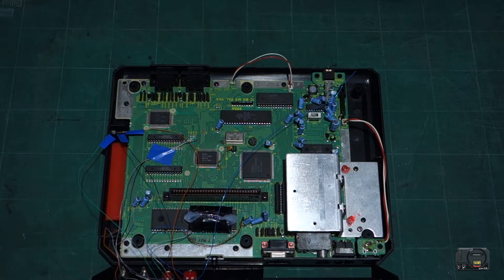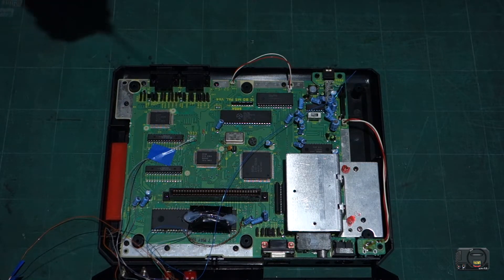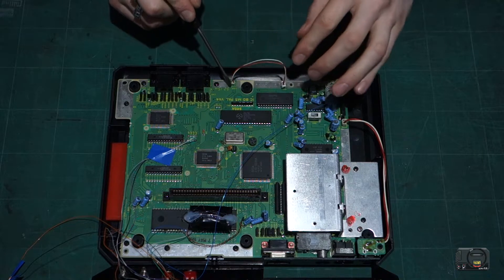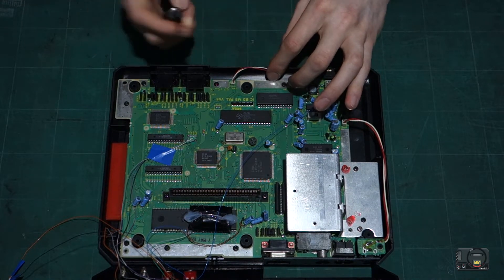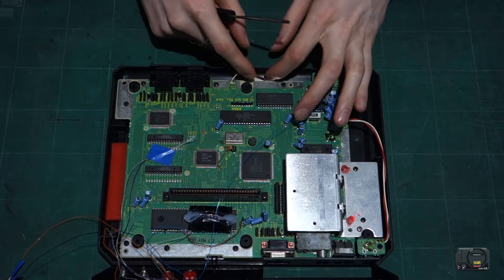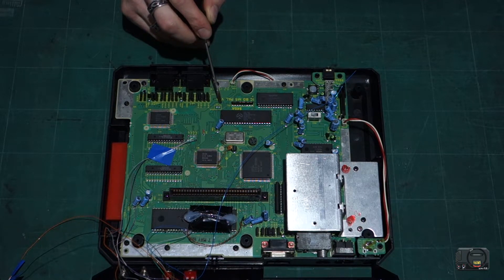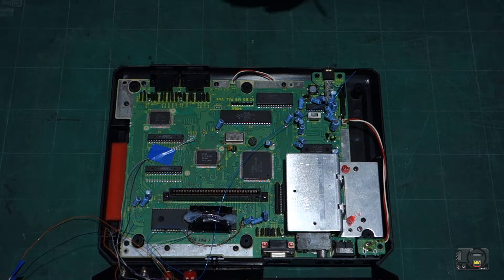Okay guys, so now it's time to solder our live and ground points, which will be our blue and black cable respectively. I was going to disconnect the little connector for the old LED and use that point, but in hindsight I'm going to leave this connector connected to the board because it may come in handy in the future - I might want to go back to a single color LED. Instead I'm going to use this adjacent point which is identical. You've got two numbers on here: number one is your live and number two is your ground. So I'm just going to solder up these two points, connect the blue and black cable, then we can test it.